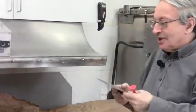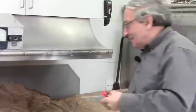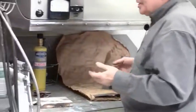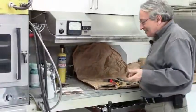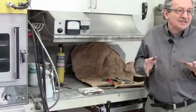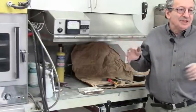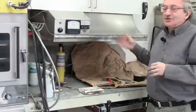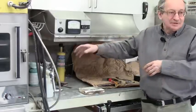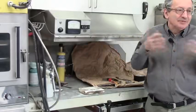Okay, so we showed you, the first way to get the wetting is sandblasting. Now the second way to get the wetting, which is not as effective as sandblasting but sometimes simpler to do, is heat everything to about 250 to 300 C, and that's easy if you have a big oven for painting, which you need anyway. So you put it in the oven before painting, heat it up, spray paint it with a powder as we'll see, and put it back in the oven to cure. So the equipment is there anyway, you may as well heat it up.